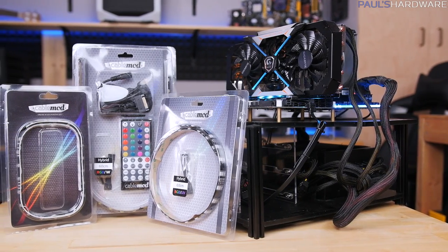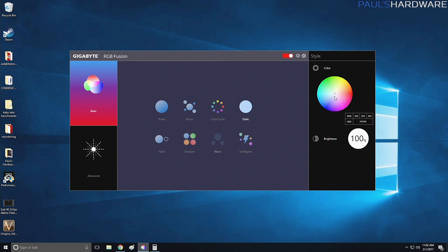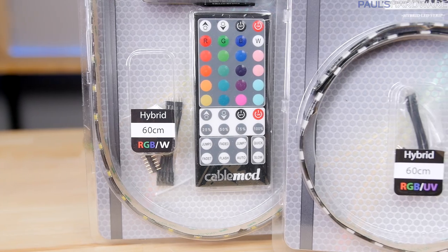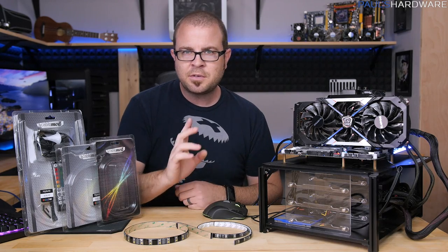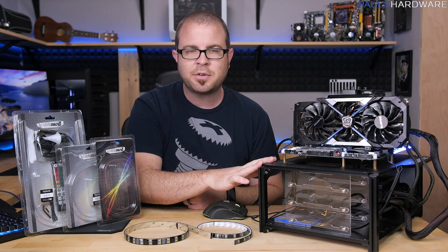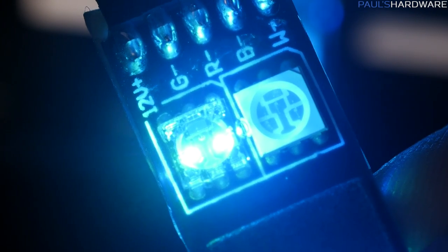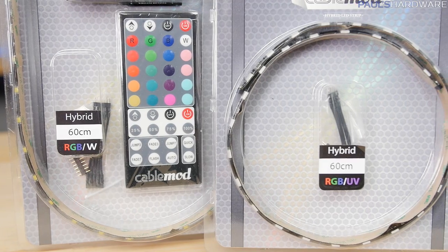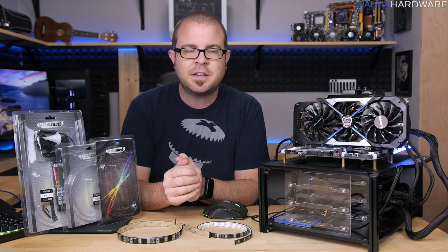For that purpose I have some brief demos here to show you. I'm going to explain more fundamentally how RGB LEDs actually work, how you can get the vast variety of different colors out of them by using motherboard software control or an actual controller included within RGB LED kits, and then a feature that I believe is exclusive to Gigabyte boards with the current Z270 lineup — the addition of a fifth pin connection for RGB LED strips, which gives you the ability to do not just RGB but RGBW, including a specific channel just for white, or RGB UV using that channel for UV lighting.